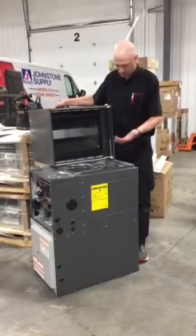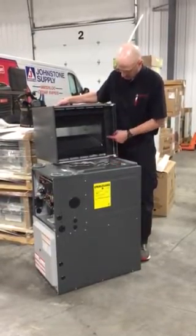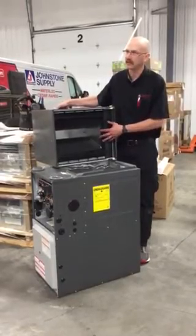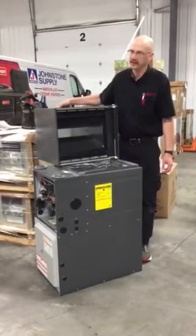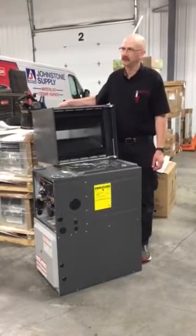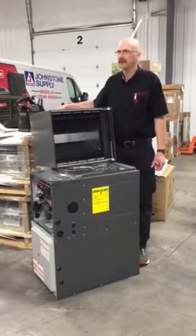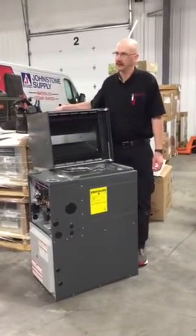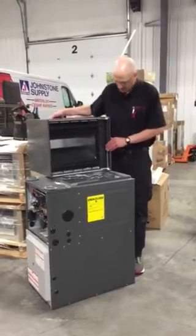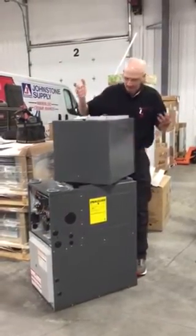In the heating mode, when the unit shuts off and you get all the radiant heat out of these tubes, you have that right along that plastic and it'll melt that plastic drain pan. Not so much an issue on the 40,000 or the 60,000 BTU furnace, but on the 80 and the 100s, it's almost a guaranteed melted pan sooner or later. So, keep that in mind if you guys have questions.